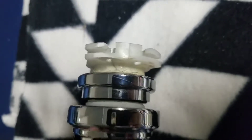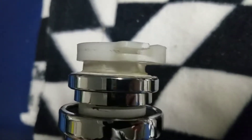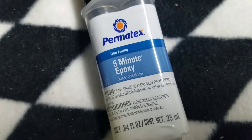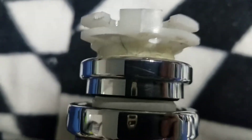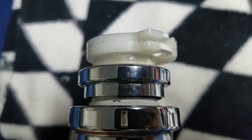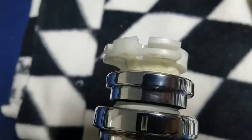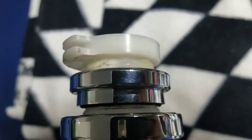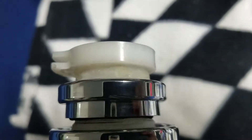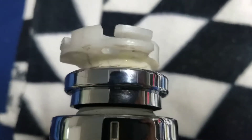The stuff that I used here is this wondrous epoxy called 5-Minute Gap Filling Epoxy. This stuff sets up in 5 minutes and is workable or usable under a stress load after 4 hours. However, I've found using it, it actually cures up quite a bit quicker than that. This has only been sitting about an hour and a half and it's hard as cement.